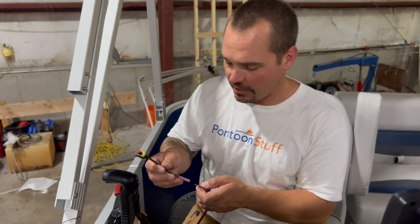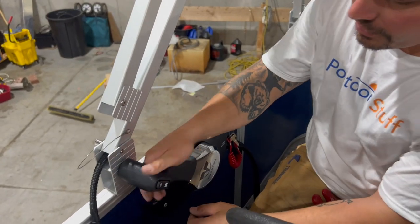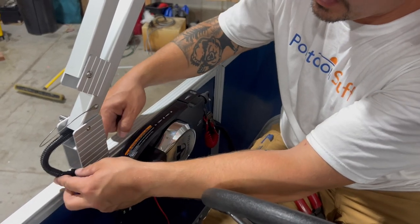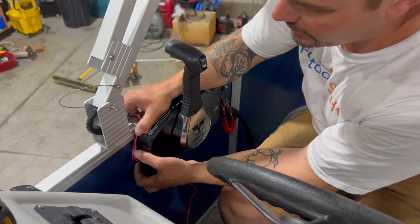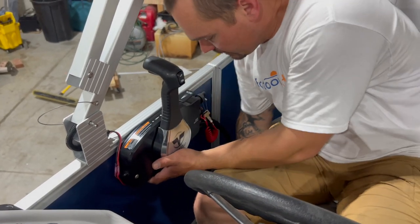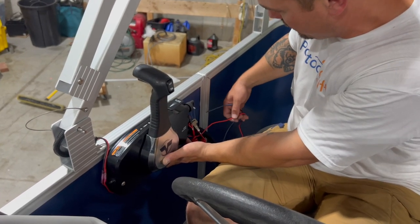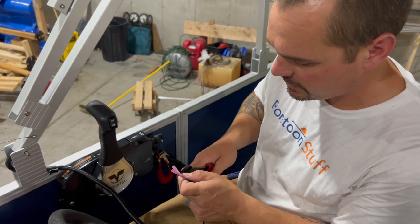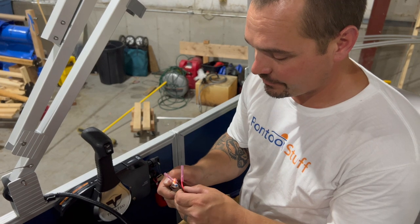I can plug it in just to see where everything's going to go and make sure we can run our throttle. I'm going to run this down through inside, straight down the front of the control box so it's out of the way. With my wiring now where I'm going to have it run, we'll cover this in that split conduit as well. I want to splice it into my ground and then that gray with a blue stripe. We'll splice that and then pull any excess down back through the floor to clean everything up nicely. I'm going to tie it in to my accessory harness again with heat shrink butt splices — we use them on everything that can get wet, which on a boat is pretty much everything.